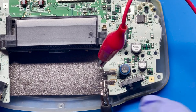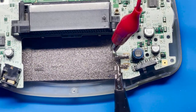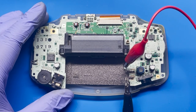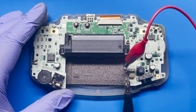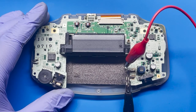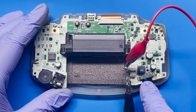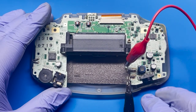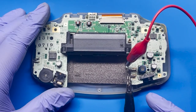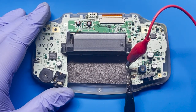I also don't have an additional fuse laying around, so I'm probably going to have to order that as well. But at least we were able to diagnose and find out the issues on both of them. Even though I wasn't able to fix any of the Game Boys today, hopefully this video is still helpful for anyone having issues trying to diagnose the problem with their Game Boy not powering on. We checked the voltage from the fuse, we checked it on the switch, and I used the schematic to determine the correct test points for the multimeter continuity test.